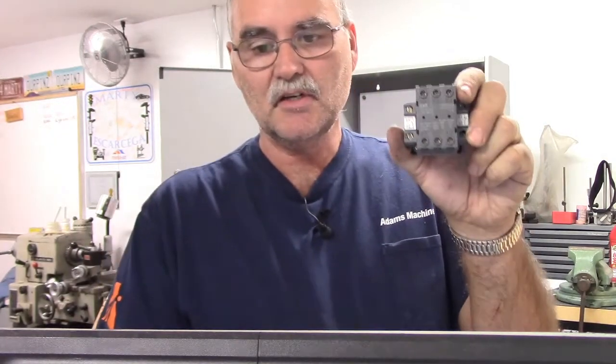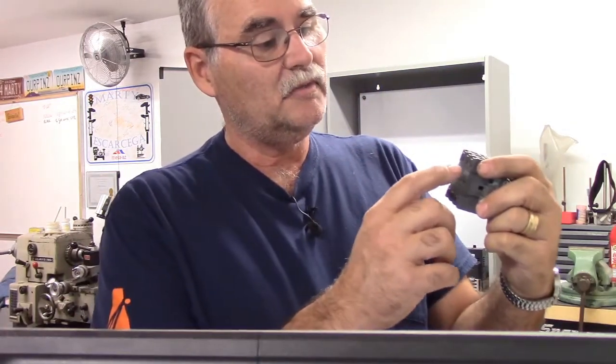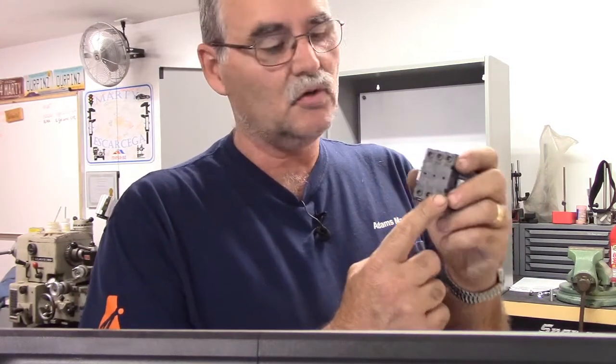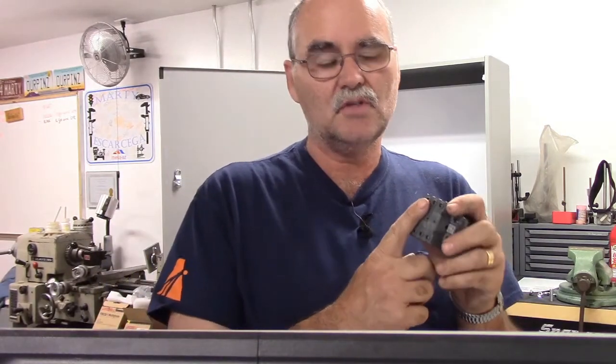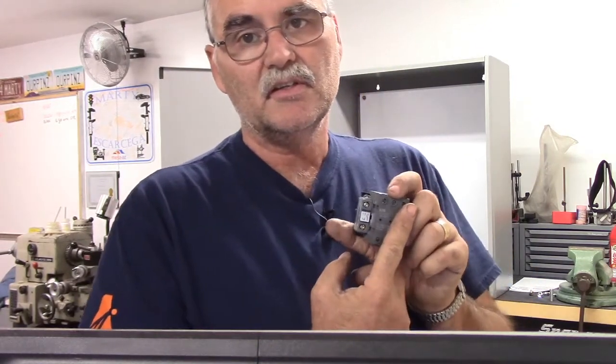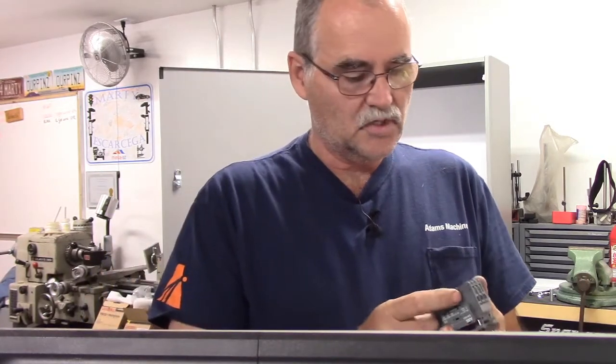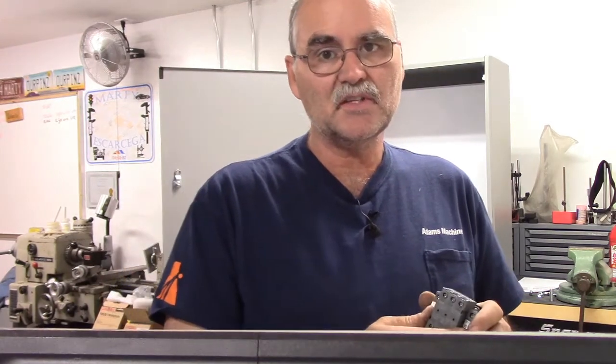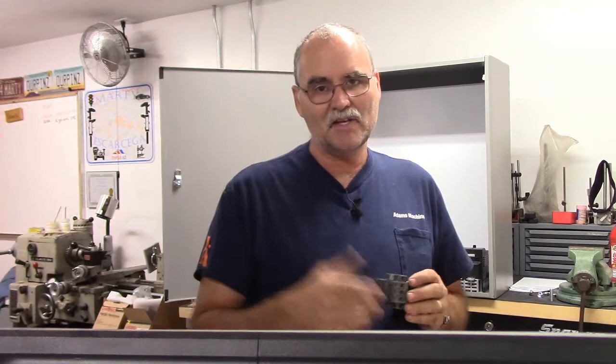I could actually use just 2 poles because I'm going 240 volt single phase input here, and then a 110 volt circuit for the all-in-one DC controller. So I actually have 2 circuits. I have the 240 volt and I have the 110 volt circuit that will be coming through for the all-in-one DC. It's just easier to do it that way. Otherwise you have to have a transformer that'll step down 240 volts to 120 volts. And my shop has both, and I have them right nearby, so I'm going to have 2 circuits.